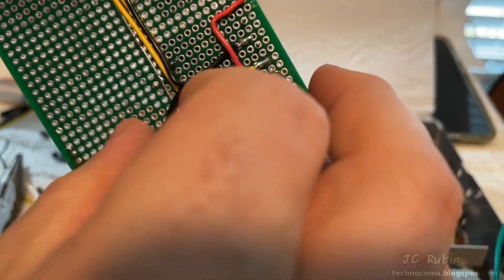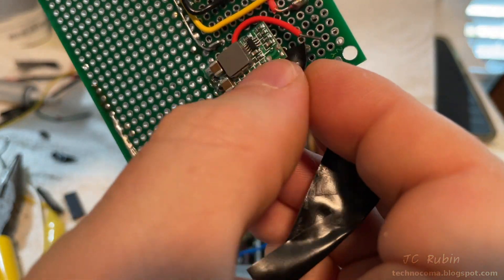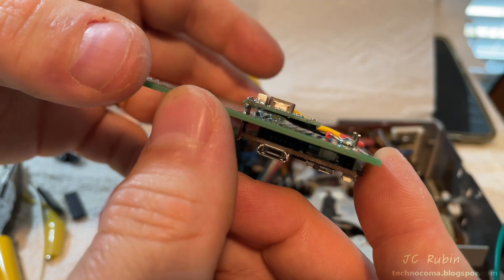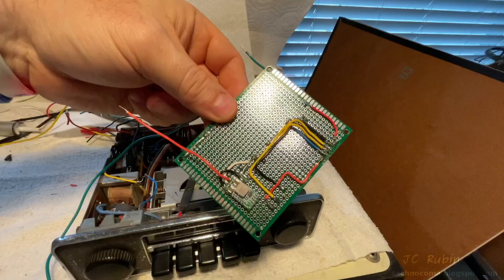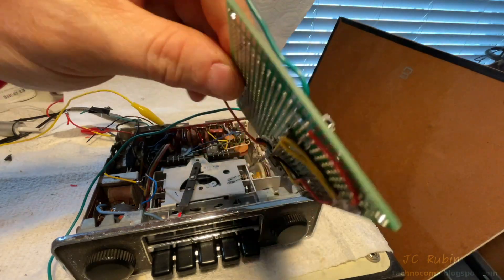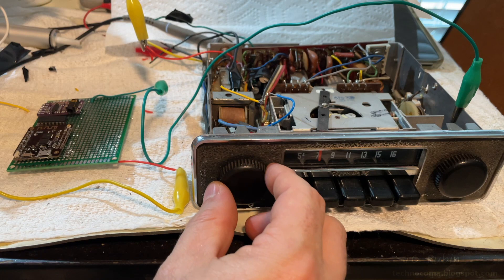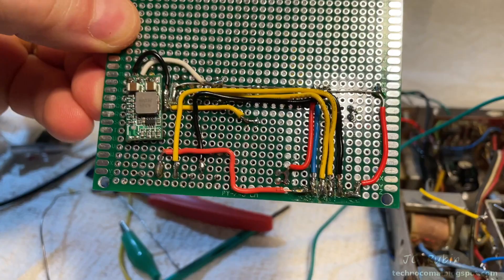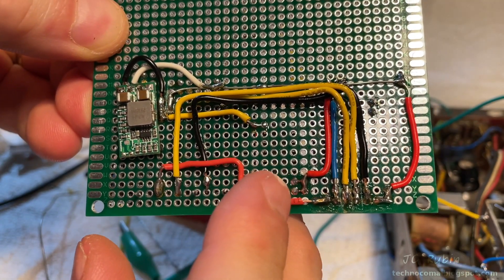Bluetooth disconnected — everything seems fine. I've cut out the voltage regulator and started replacing wires with pins. I've taped it to the board with a wire under it so I could get just the right amount of elevation. It's on the back of the board to cut down possible noise, and here it is installed — very nice — with three pins protruding from the other side. I've wired it in with one red wire on one side and a green ground from the main ground on the other. I tested the five-volt regulated voltage before attempting this, and everything worked fine when turning on the radio.